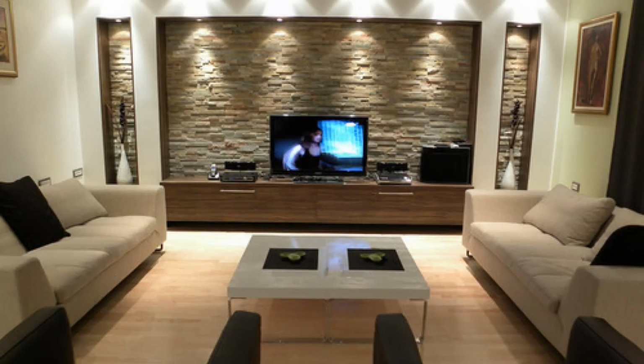Also, when you don't have a room with 4 walls, your acoustical environment isn't as well controlled. So it's difficult to get good bass response in a room like that. It's difficult sometimes to mount rear speakers or back channel speakers, so sometimes you have to go with in-ceiling speakers, which is fine if you have no other choice. But if you could start with a basic rectangular room with 4 walls, or a room that closes itself off so it's not part of a super room in the rest of the house, you're way ahead of the game right there, guys.